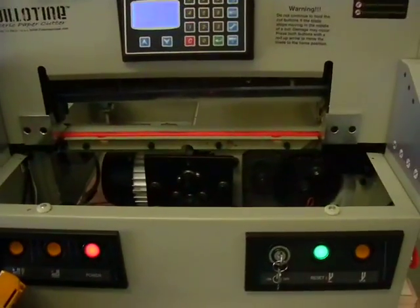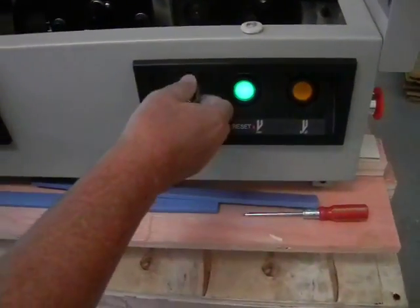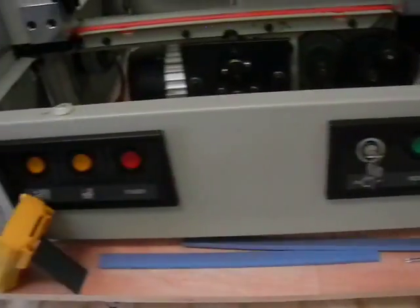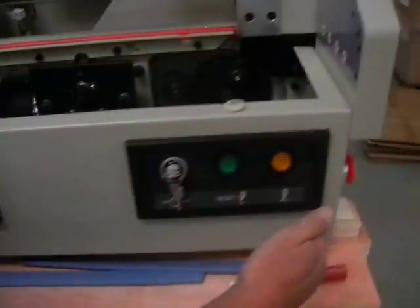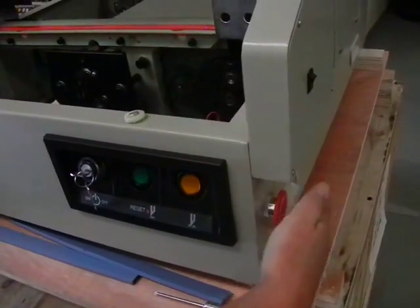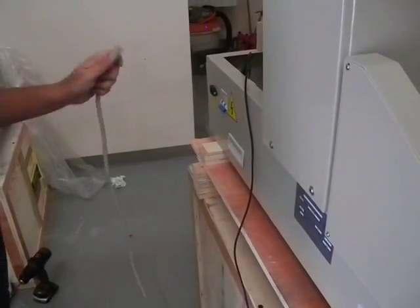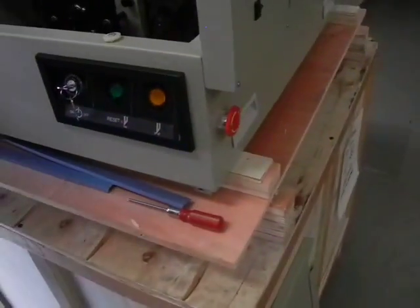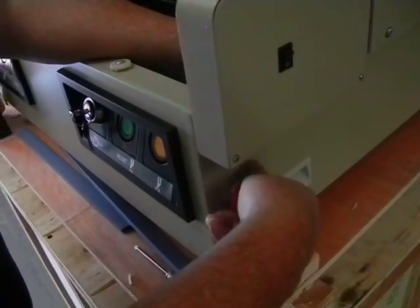It's just a small circuit there. You can see this machine is on right now. I'm going to turn off all these switches first and unplug it. I'll shut this switch off and shut off the emergency — I'm going to pop the emergency in, so that's off as well, all switches are shut off. I'm going to unplug it too, and the reason is I'm going to move the emergency switch to an easier place for me to take a reading, because it's really hard to get back there when you're trying to do a voltage reading.